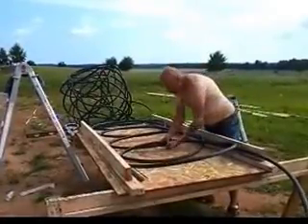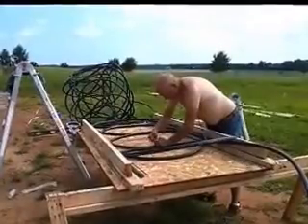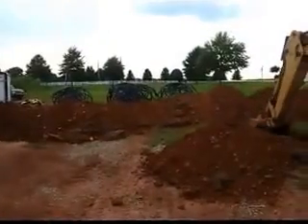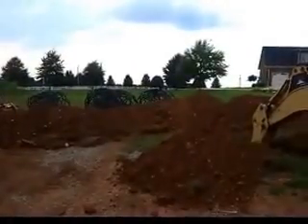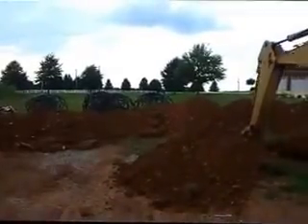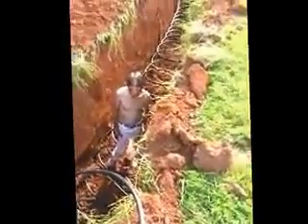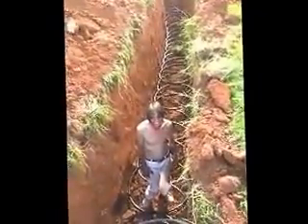What we're doing is we've taken our coils and made them up at 36-inch lengths, overlapping at 18 inches, and we'll deploy these once we have our ground loops dug. We've got all of our loops gathered up and ready to go. As soon as we dig the trenches we'll be able to lay them down — 70 feet, 36 inches wide. We're starting our second trench right now. My buddy Travis is down in the hole helping us lay this geothermal tubing down in there, seven feet down.